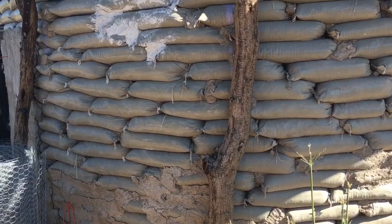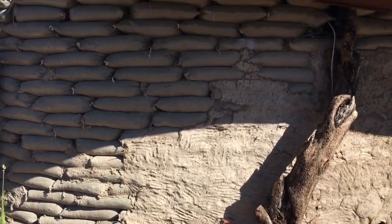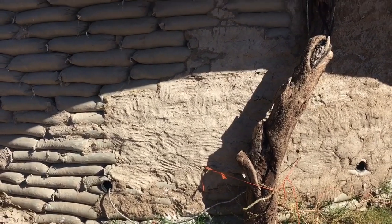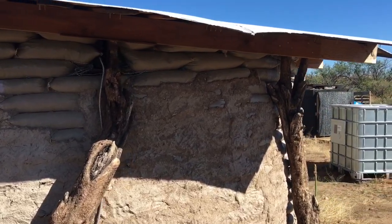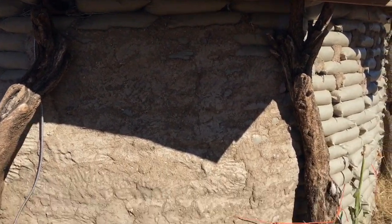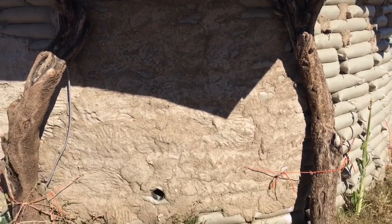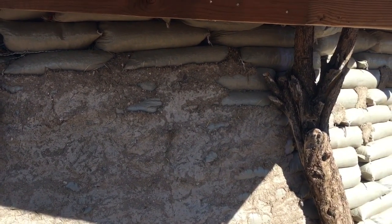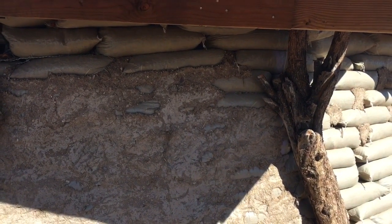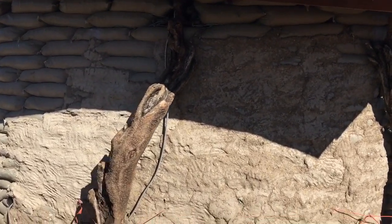You can see the remnants over here — this was the very first thing I did, just plain old cob without much sand, and it actually just fell off once the rains hit. Over here is the best non-stucco coating I found: cob mixed with lime. It stayed on but cracked more. Then this right here was cob with more sand — it stays on but looks crummy because the rain just pelts it. In monsoon season the rains come nearly vertical, so the walls got hammered.